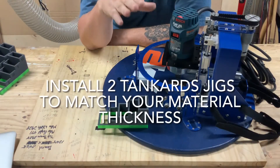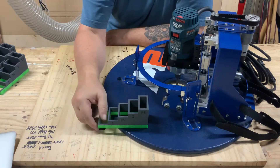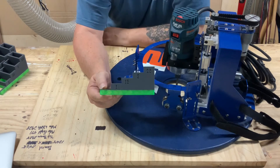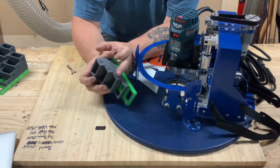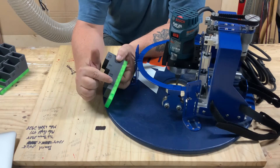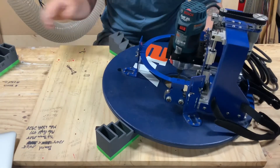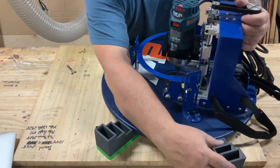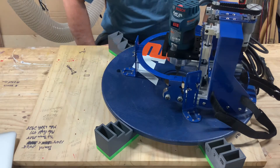The first thing you do is take your M2 sled, take it off the wall and put it on a flat surface. Then grab your four jigs, marked from a half inch all the way up to 2.5 inches. Place them in four areas around your sled based on whatever depth of material you want to cut. I usually cut three-quarter material, so I put my four jigs on the one-inch step all the way around. Once I have it set, I'm ready to adjust my Z-axis to my cut thickness.